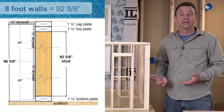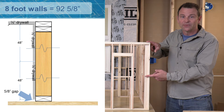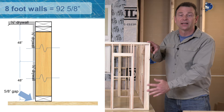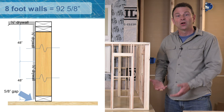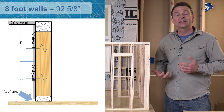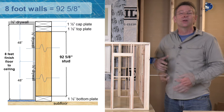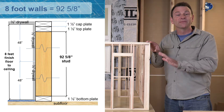What is the purpose of that extra 5/8? That's the question I always get. What we're doing in an 8-foot wall is we're running our drywall in 4-foot sections. Once we add our ceiling thickness of drywall in, we add our wall drywall of 48 inches under that and then another 48 inches. That 5/8 at the bottom gives us room to jack that drywall up for a tight seam right in the middle of the wall. The magic of a 92 and 5/8 stud is that it saves us time — we don't have to make any cuts. They're all exactly the same length, and if we put this wall together with our double top plate and a single bottom plate, we end up with a finished dimension of 8 feet from the inside of the ceiling drywall to the floor deck.